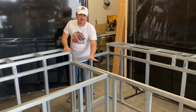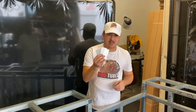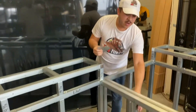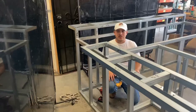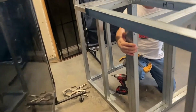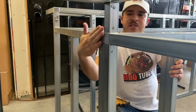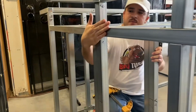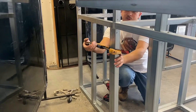Now we'll go ahead and install these CPS or connector plates and show you how to put them on to tie the modules together. We're going to butt these two modules up together and go ahead and clamp the back sides. You really want to make sure that these modules are real flush, so we'll clamp the back tubes nice and tight so they sit flush.